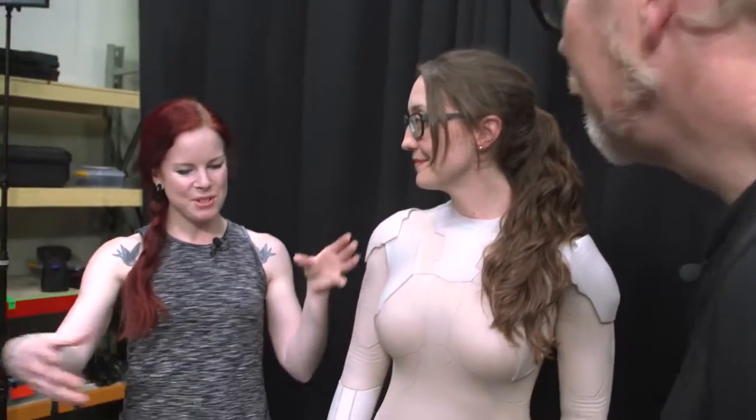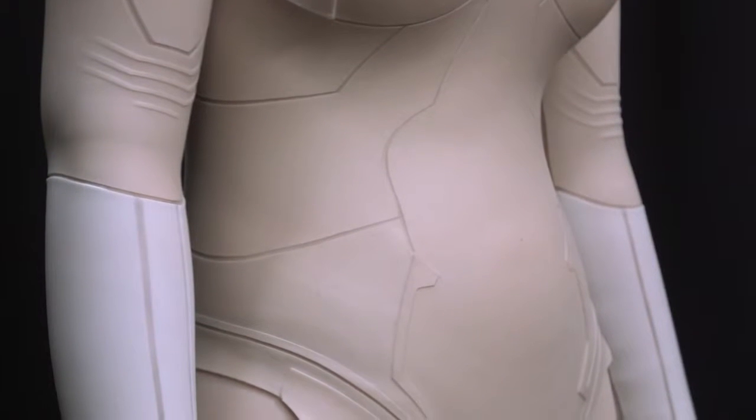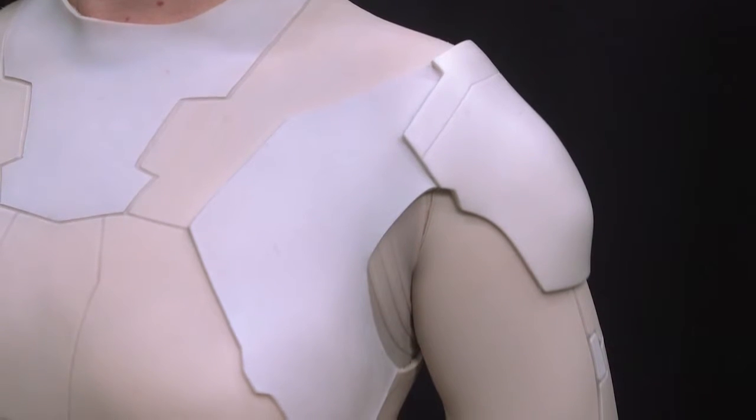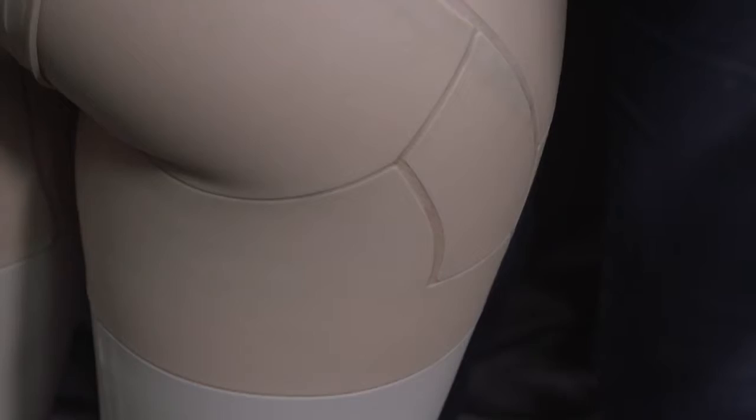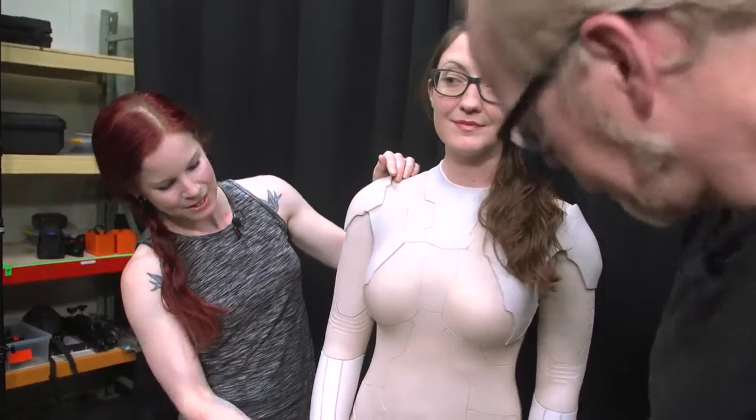Because you want it to fit tightly, which means the suit has to be smaller than the actor. So we had to reduce the buck — the core of the suit — to the size that a bathing suit would be. And we were really lucky that it worked. From there we took that reduced buck, that reduced core, to the 3D department. They scanned it and then transferred all the design lines that you can see onto that. Milled out in plasticine — a really firm plasticine — then finished by hand, then moulded, then cast. It was a process.